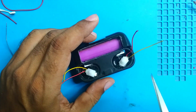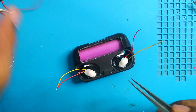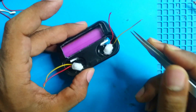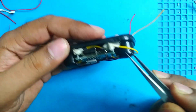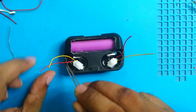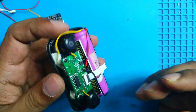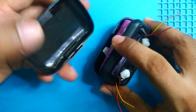It doesn't look great but I don't care — there will be a cover here, so nobody will know what's inside. For the final wiring: I take negative connections from the board — this one for one module, here from another module. The positive side is soldered directly from the battery to one switch, then to the other switch. After the switching, that's our positive line.